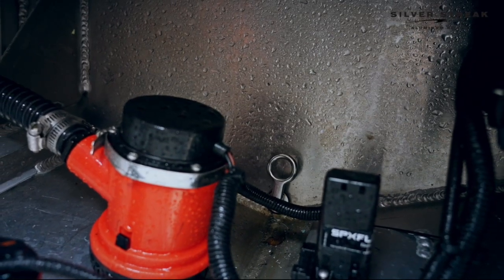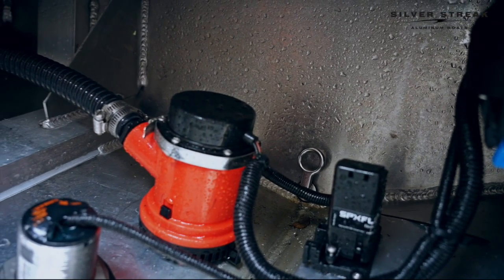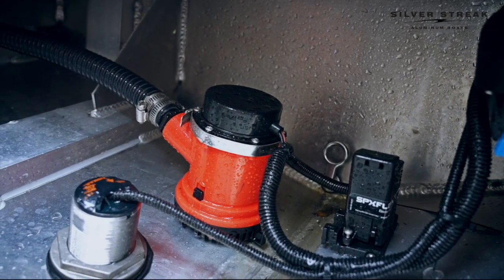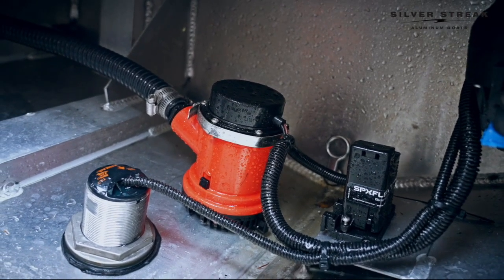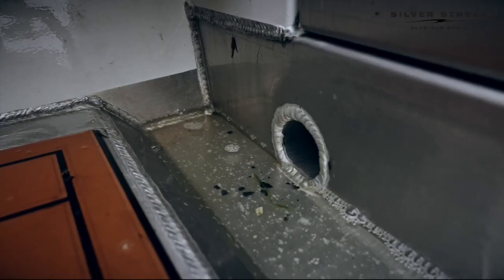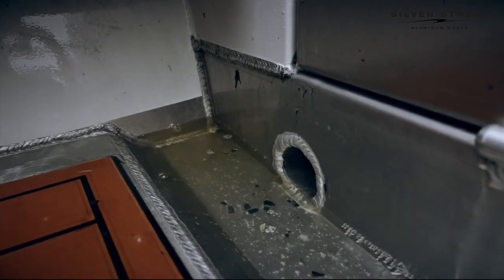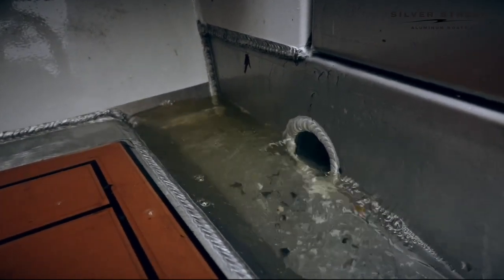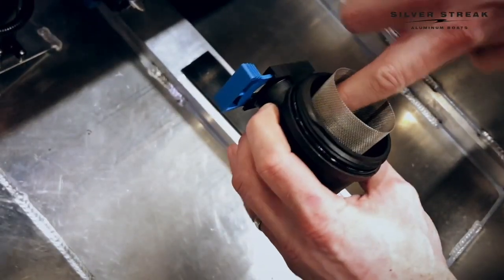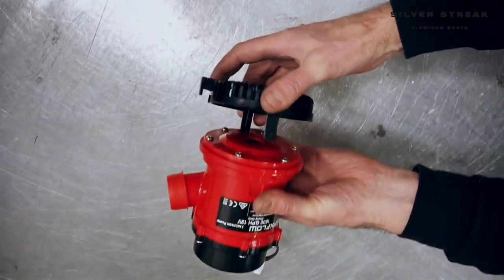Whether a self-bailing or a non-self-bailing deck, your boat will come standard with a bilge and bilge pump. The pump may be manual or automatic and functions to remove any accumulated water in the bilge compartment and out of the boat. Again, if this compartment or the gunnels funneling to it have debris in it, you could find that the bilge pump will not function properly. These pumps are made removable, so you can easily check the screen or strainer and clean as needed.